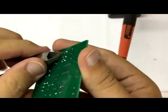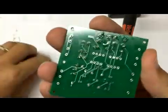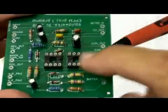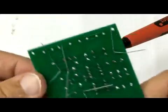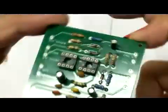That should do it for all those guys. Snip off that last lead. I also added these — not so much because I'm afraid to actually solder in the 8-pin dual op-amps, it's just that I really wanted the option in case I want to remove them and try out a different spec. Do these last few little cat whiskers and then I can start putting the peripheral stuff on.